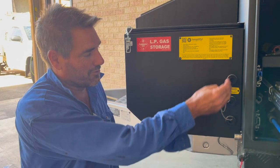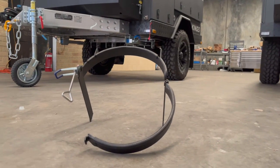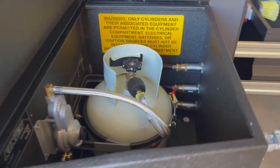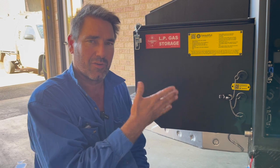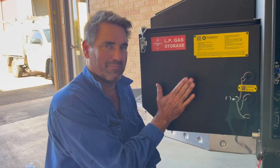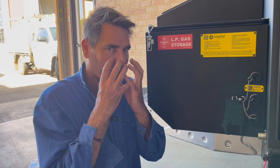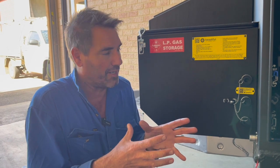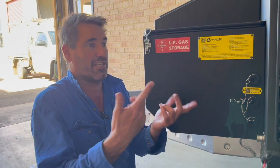Here are the three bayonets all on top of each other — fits really nicely inside the box. We just had to cut the old bottle holder out and then shift the new 4.5kg one over a little bit. The bulk of the bayonet body is sitting back in there so they won't get bumped or anything like that. If you do cut them out with the angle grinder, this stuff is super hard to cut and it does give off fumes. So make sure you're in a very ventilated area and even have a fan blowing. Make sure you've got your dust mask when cutting out and installing the new 4.5kg bottle cradle. All turned out pretty cool — I'll show you how the kitchen sink and everything worked out.